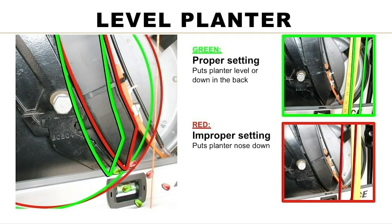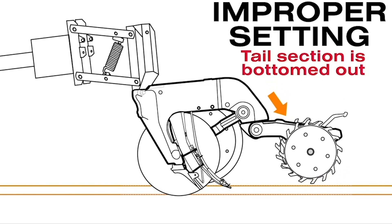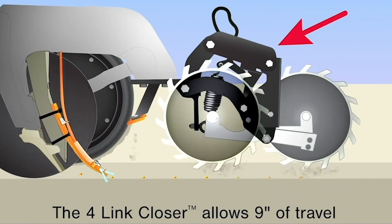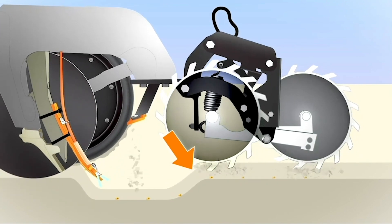When the unit is pushed down in the front — an improper setting — look what that does to the seed tube: it kicks seeds back. You'll get dry dirt dropping down with the seed. But if the planter is tilted back, the gauge wheel won't drop loose soil in with the seed. On a new planter tilted too far forward, you've only got two to four inches of travel from center, so it's bottomed out. Our four-length closer moves eight to nine inches up and down and does a good job — you're not leaving seeds exposed or failing to close the seed furrow.